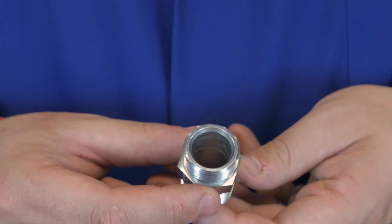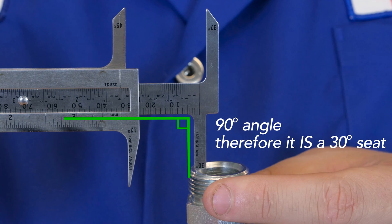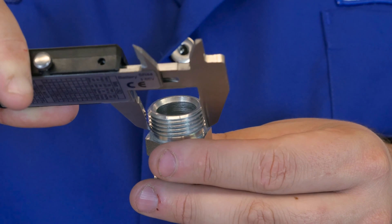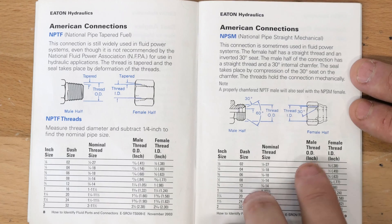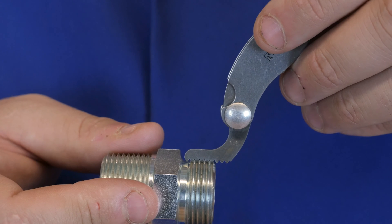To identify a male NPSM thread, we start a little differently than the female thread, by measuring the internal seat present at the top of the thread. Here you can see that we have the caliper at a 90-degree angle to the fitting. The seat in this fitting is in fact a 30-degree seat. Taking our calipers, we now need to measure the OD or outside diameter of this fitting. Because it is a straight thread, we can measure anywhere along the fitting — just make sure your calipers are at a proper angle. This measures 1 and 1/16th inches. Subtracting 1/4 inch from this measurement gives us our nominal thread size. Consulting the book, we can see that the fitting with an OD of 1 and 1/16th of an inch will have a nominal thread size equal to 3/4 inch, dash 14. Taking our thread pitch gauge, we can confirm this one last time by comparing the number 14 gauge to the threads on the fitting. This confirms that this is a dash 12 NPSM male fitting.